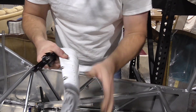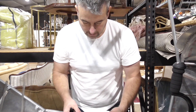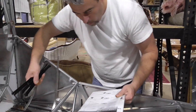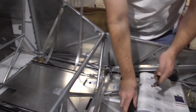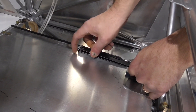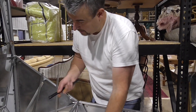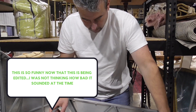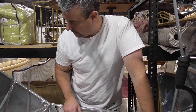It looks like 26 bucks for a five-piece set. Some are inverted so you can go up through the bottom of the hole — I've never had to use that, maybe I probably needed it but didn't know what it was. I wish I would have had a 13-inch because when I did this hole, the six-inch was literally that close. I had to do it by eyeball and it was a little bit off, so I had to make the hole bigger. That's the first time I really needed longer than six inch. So if you can live with making that hole bigger, just get the six — or get the 13 inch, though sometimes you can't fit a 13 inch in some places.